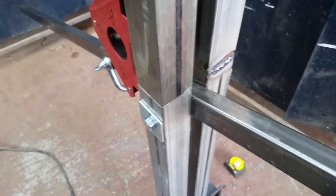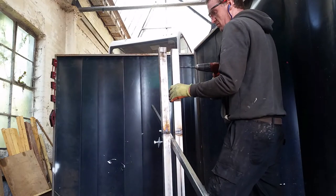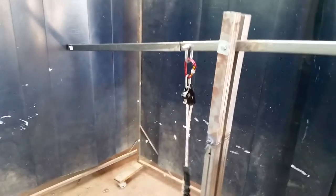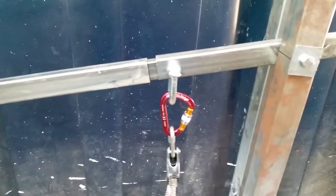If the crane's at this height I want to have the option to keep it at this height but also be able to have it up near the top as well. I've got to line up pretty well on the holes — I did that by using a square to connect the dots through from one side to the other and then using that line to eyeball it as I was drilling. You can see I've got the machine suspended here, just holding its own. I've lifted it by hand by pressing down and then locked off the rope grab, and that allows it to hold.